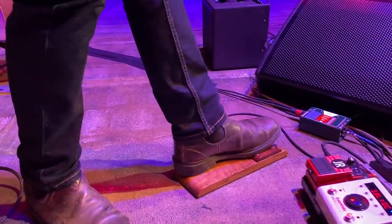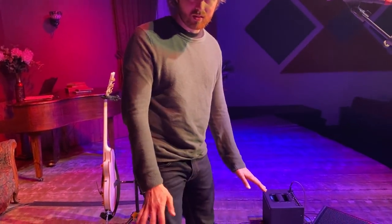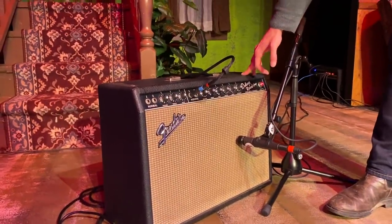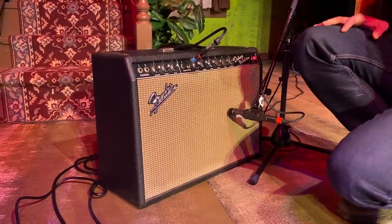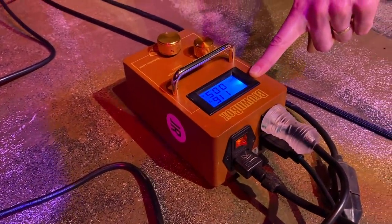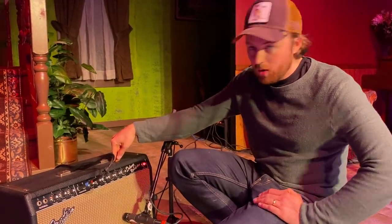I do use this stomp box, which has just a percussive thump, which is useful when I do a solo electric song, because the electric guitar doesn't have a lot of low-end like the acoustic can. So that gives me a little bit of reinforcement on the groove. The amp I'm using is a Deluxe Reverb — this is a 1966, I think late 1966. It's a great amp. I put a Celestion in it recently and that sounds pretty slamming. I do use a little brown box here, which is a voltage regulator. The voltage here is 127 volts, so I have it stepped down to 116. These amps are rated at maximum 117, and they do sound a lot better if they're a little closer to the voltage they were designed to be run at.